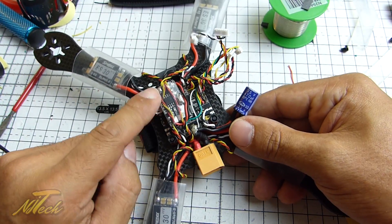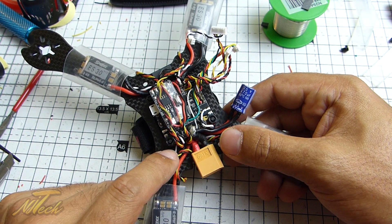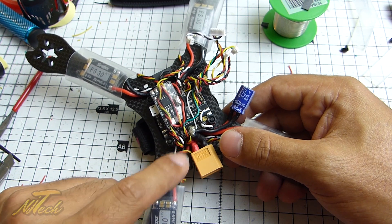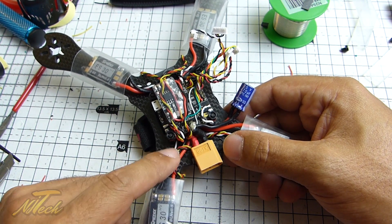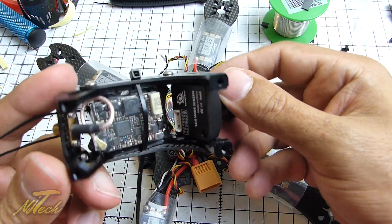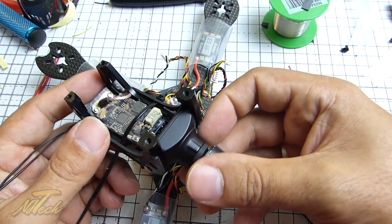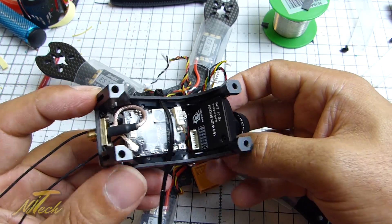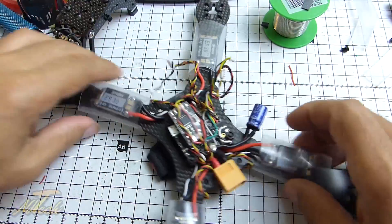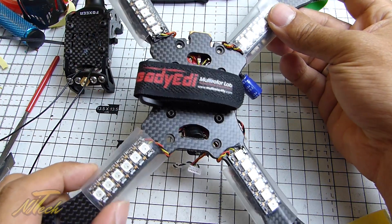Okay, so we're pretty much there now. We've got the chroma mounted on top of the flight controller, and I've tucked a little bit of extra wire for the LED wires underneath the board — so that when I need to flip this up and service it, I'm not stuffed and all that hard work with the ESC wires doesn't go to waste. That is what the roof pod now looks like: we have the Foxeer camera nicely mounted after making that little modification grinding the edges on the mount, and you can just see the XSR and the VTX up in the top there. Last thing was just to wire in the LEDs, and then the heat shrink will go over those once they're done.